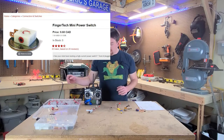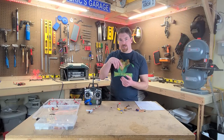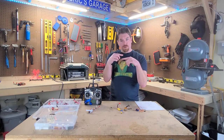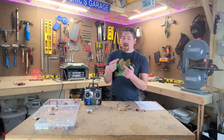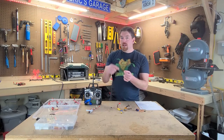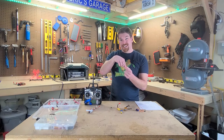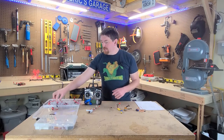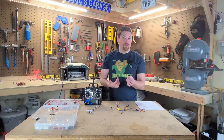Once you add an active weapon, you're going to be asked to have some form of safety switch. I've developed my own, very similar to the FingerTech safety switch — which like all their stuff is expensive but quite durable. The safety switch is usually an Allen key screw that makes contact with two pieces of copper inside. You put the screw through the two pieces of copper, it completes the circuit, allows electricity through, and that's how power flows to your robot — guaranteeing it shouldn't turn on unexpectedly.